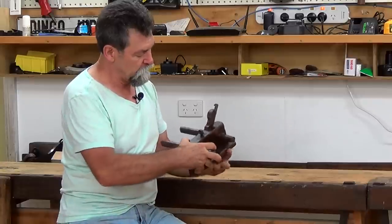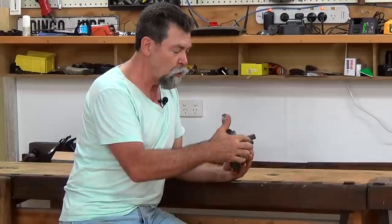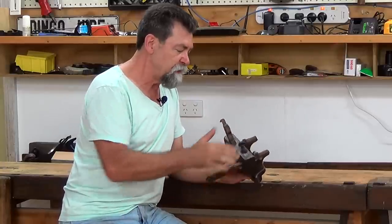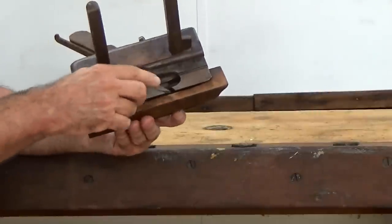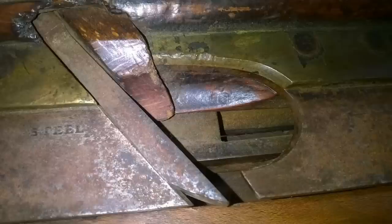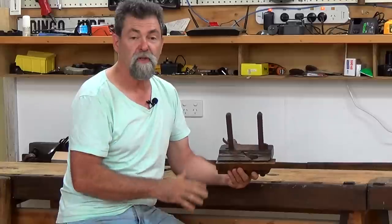The width away from the edge of the piece of timber is governed by where the plane body moves out on these two arms. The fence is stationary — the plane moves along the two arms. The area where the plane is actually cutting the timber, you can see everything was crafted in an amazing way. The escape area here is just beautiful. The wedge is even shaped with the escape in mind. The brass is all shaped that way as well, and the timber in the plane behind it is all shaped just beautifully, so nothing is going to catch.